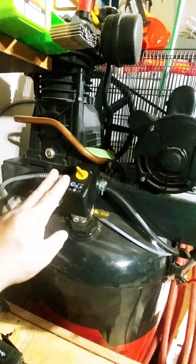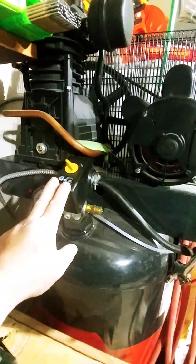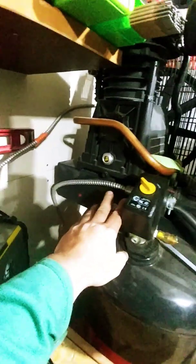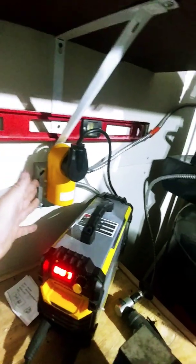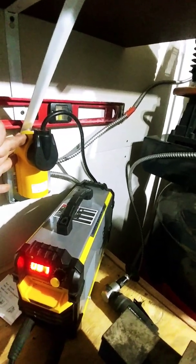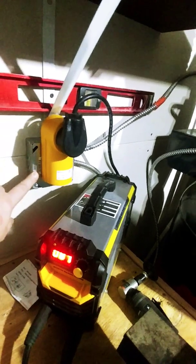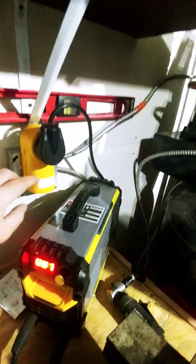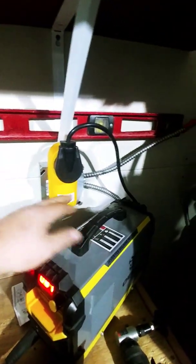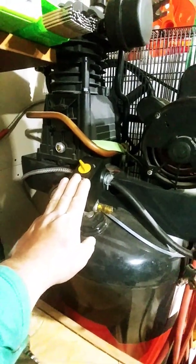And what I did was, I originally had the feed coming right into here. My panel's like 10 feet away. Because I don't have a lot of space in my panel, I ran my feed that was originally going into my compressor into this 4-square electrical junction box here. And I bought this 220 outlet off of Amazon. It was like 18 bucks, and I mounted it to the face here. You can buy a 4-square with a knockout in the back, has a hole in the center. I took the feed into the junction box, and then I fed my 220 plug for my welder, and then I came out of that same junction box and I hit my compressor.